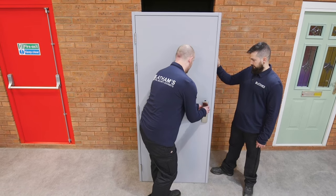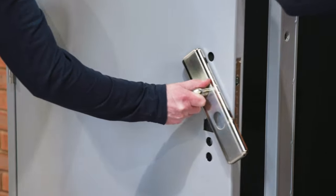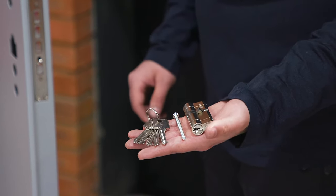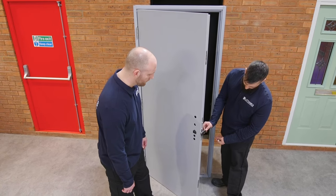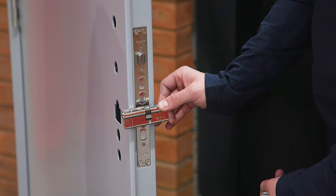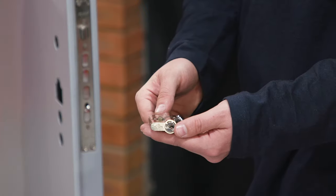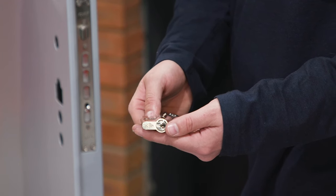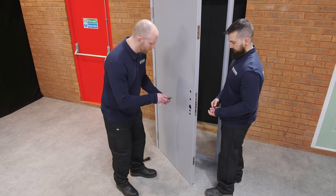Using the spindle and a loose handle, open the door leaf. Fit the cylinder to allow for testing of the locking mechanism. Looking at the latching side of the door, locate the sash lock — the main lock in the centre. Insert a key into the cylinder and turn slightly, centering the rotating cam. If you have a double door, the cylinder is installed when the door leafs are fitted back onto the frame.